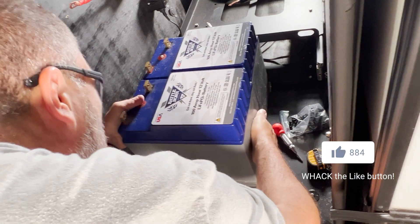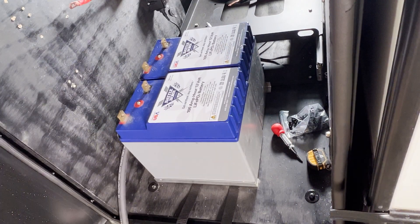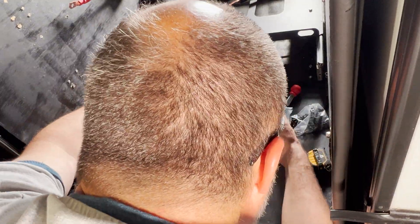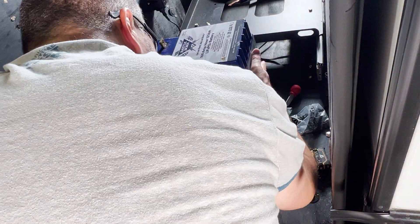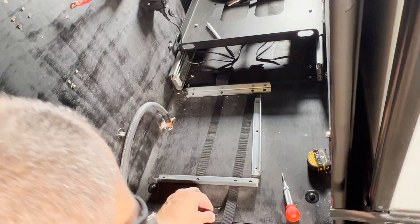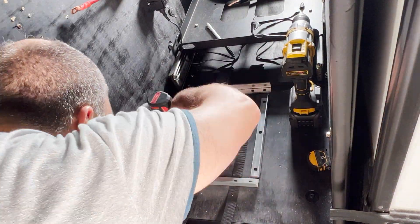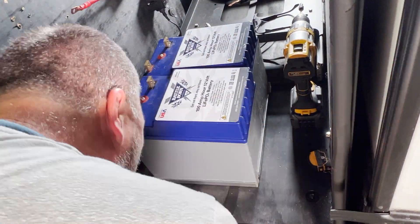If you've found this video useful so far, I'd appreciate it if you hit the like button so it can spread to more people who would find it helpful. With the end pieces completed, I repeated the process with the sidebars. I dry-fitted each bar against the batteries, carefully removed the batteries without moving the bar, pre-drilled the holes, and screwed down the bar. I noticed reviewing the footage that the sidebars were asymmetric — I'd eyeballed the center screw placement and was a little loosey-goosey with it. It doesn't change the quality of the build and isn't visible, but it was sloppier than I usually am. It's not worth undoing everything at this point, so hopefully you and my OCD will forgive me.